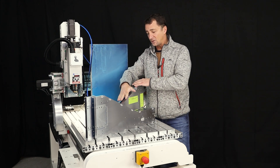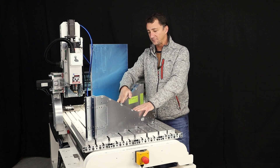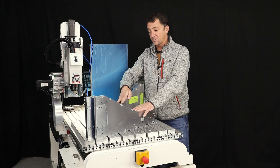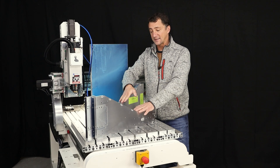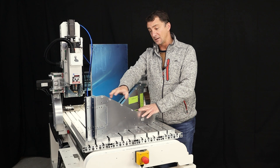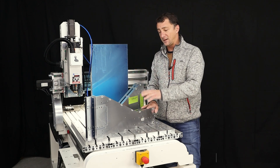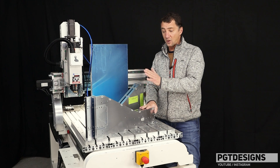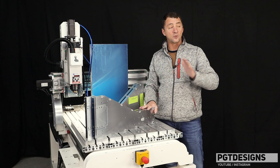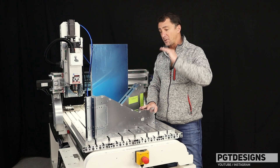Here I had to make changes to the feed rate and spindle speed from the first two to the second two. And even at that, I can already see that the second two I made show a significant improvement in surface finish. I can already see this getting close to what I used to get on the Symbiosis — very few of those little ripples that you would get.